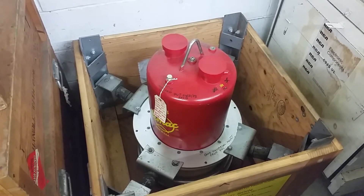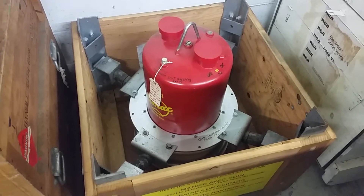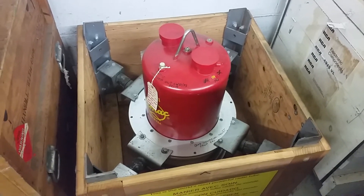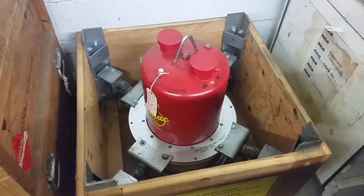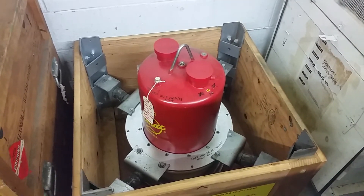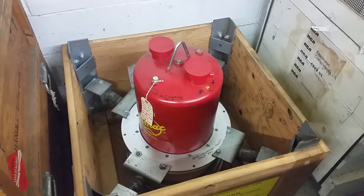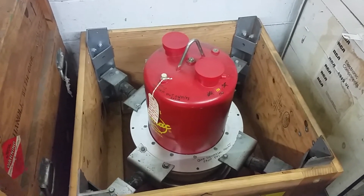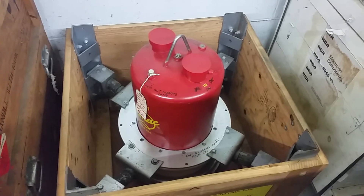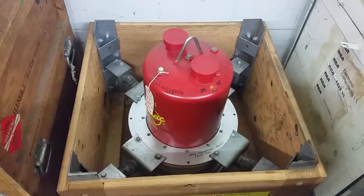I'm going to get rid of these probably — I may trade them off. It's a long shot, but maybe someone has some neat computer stuff they want to trade. The market for these things is extremely limited and shrinking fast, because with solid state you can make a redundant transmitter with many little modules doing 10 kW each — far more reliable, efficient, and cheaper. These tubes were horribly expensive, but even if they're duds they're still rebuilt to this day — you can take them apart, pump them down, and put them back in a transmitter or a fusion reactor.